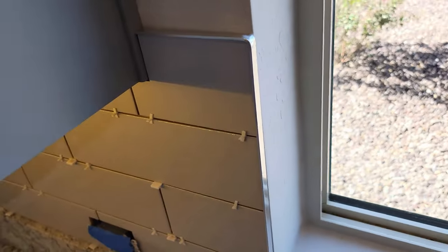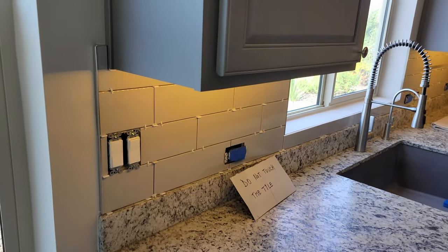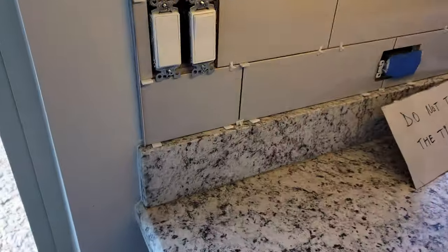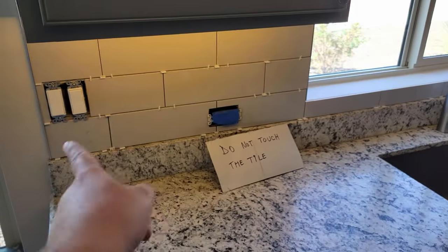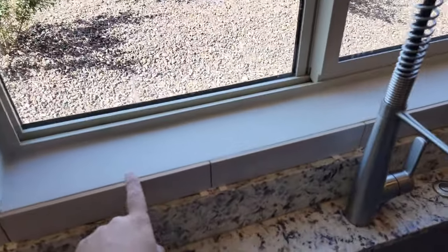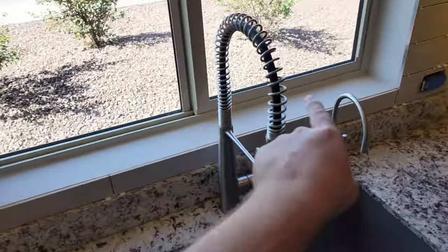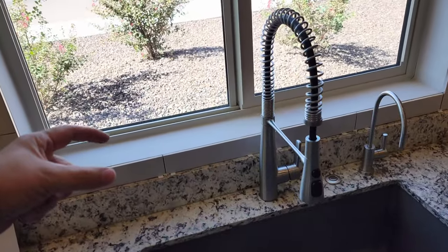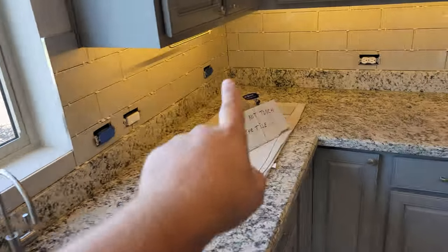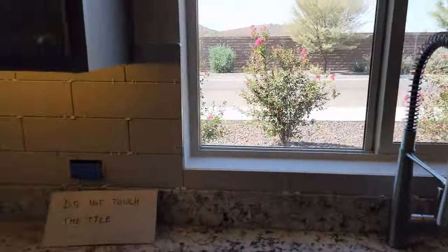Here's another piece of jolly trim — that's how it looks, and this is the end or beginning of the backsplash. We have about a quarter inch that had to be done this way, so we have full tile, full, half, avoiding any little pieces of tile anywhere. These areas here are going to be covered by a piece of marble or granite — a one-piece slab about 47 inches long by five and a half inches wide. Then grout tomorrow, put back all the outlet covers, and that's how this job was done. Hope this helps and good luck with your backsplash.